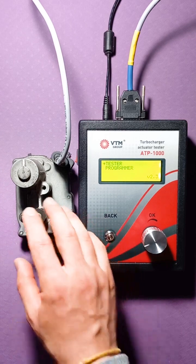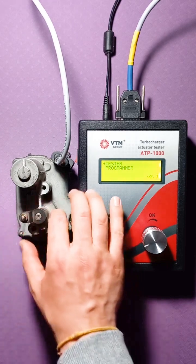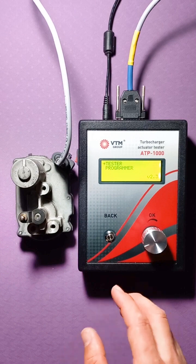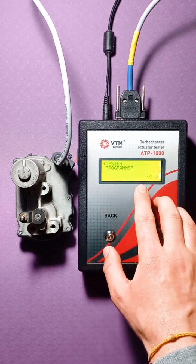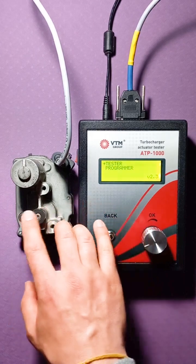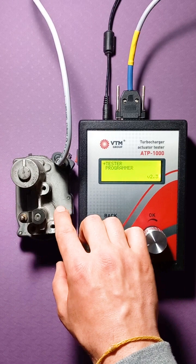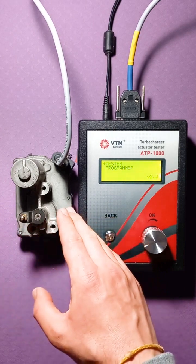It's just that in the variant of a free actuator, programming will not happen for you, even if you enter the program mode. It will not find its hard stop, will reach the end of its scale, will determine that it did not meet a hard stop on the way, and will leave the previous value that was programmed on it.